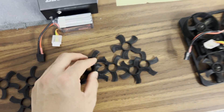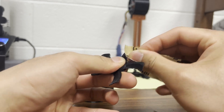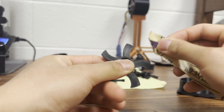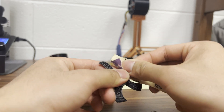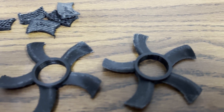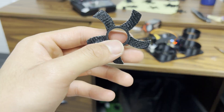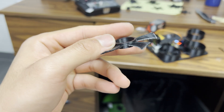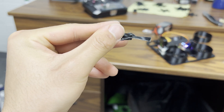Since I'm really pushing the limits of the printer, I'm forced to rely on post-processing to get the fans to a reasonable precision and consistency. All this really means is that I sanded each fan pretty hard after they came out. Here, a post-processed one is on the right and a freshly printed one is on the left. You can see that the trailing edge in particular is a lot more detailed on the post-processed one, and even though the bottoms are kind of janky, the air profile still came out pretty well.